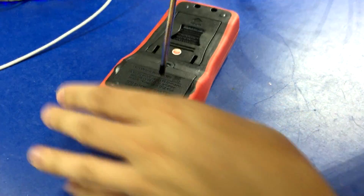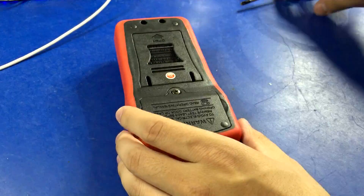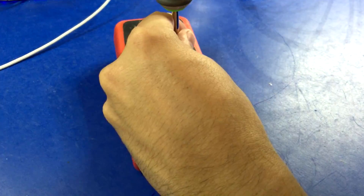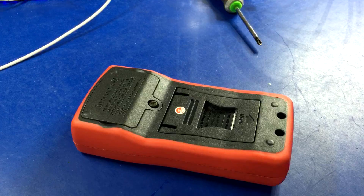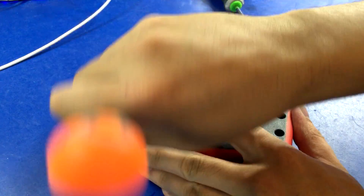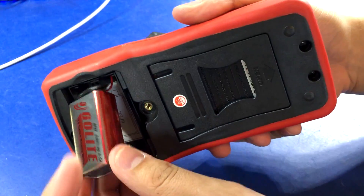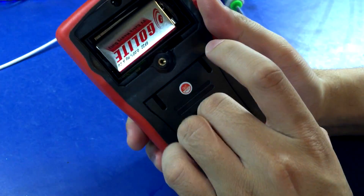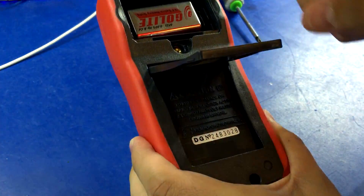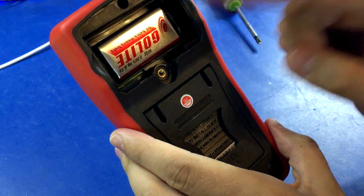TechPower TP2844R. Looks like a big battery door right at the top. Hmm, screws out and I can't get it open. It is a machine screw that goes into a metal nut. But wow, that's crap — there is no slack on that. That would be really hard to replace that battery — that's all the slack there is. And then there's no fuse access. At least there's an insert and you can get to it without taking the whole thing apart, but it's a crappy battery snap with no slack. That's kind of crappy.